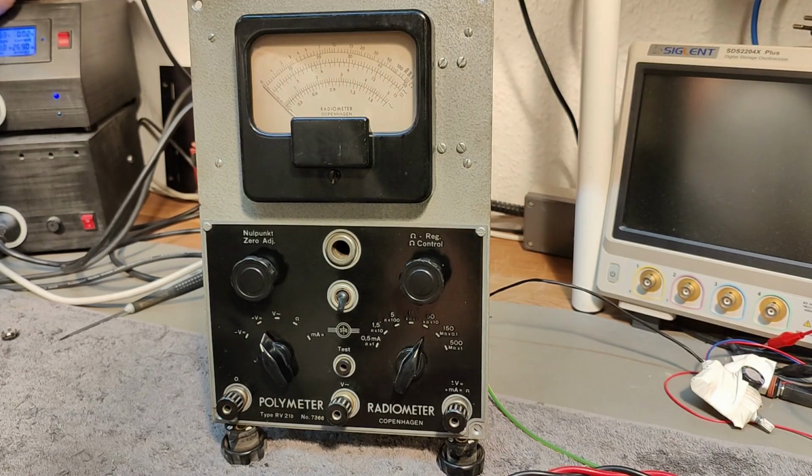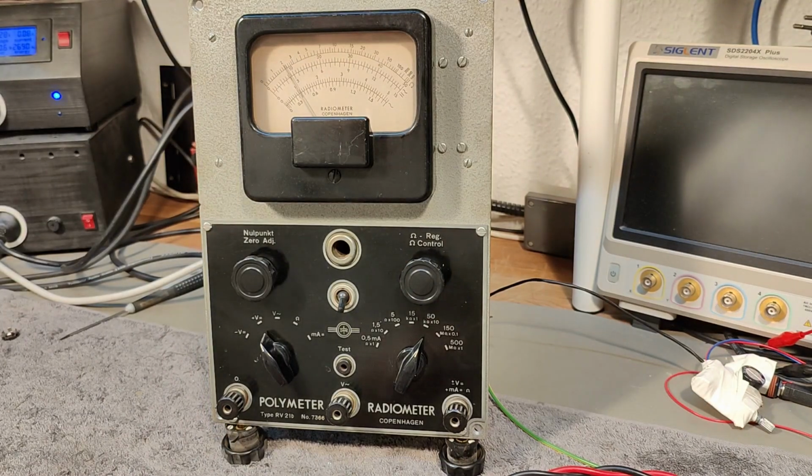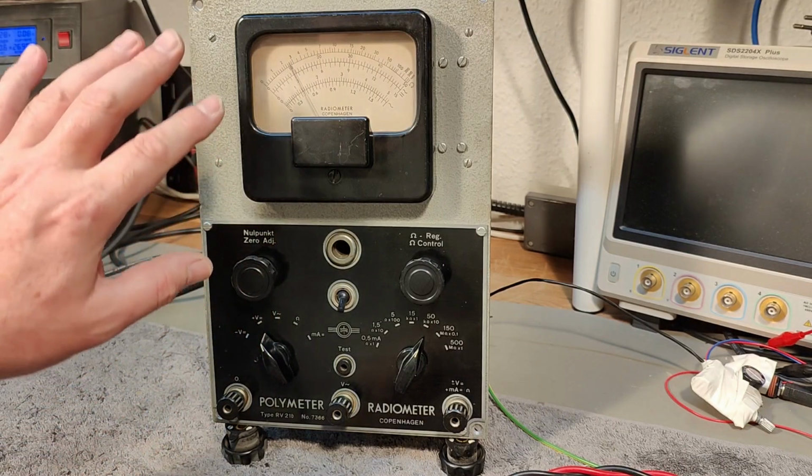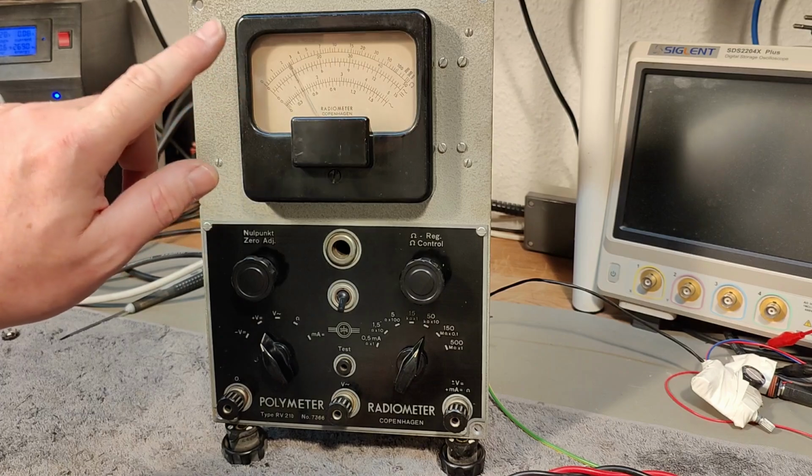And I put in a new fuse and it's now nicely connected. That is 100 volts and it's using 3 watts. And then let's just crank it up real fast. That will be 200 volts, 8 watts. And then we have some response and it's 230 volts using 10 watts. And we are in DC volt mode. And it's nice and stable right here.